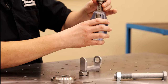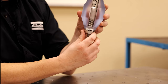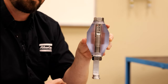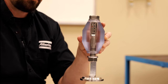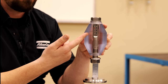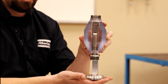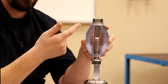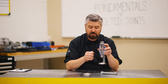So if we build up this joint here and put this together, let's not tighten the bolt — just run the nut down until the parts are squeezed together, so we have basically zero on this scale. If we apply a service load, we see the force increases up to about two. If this is a cyclical load coming on and off, the bolt load is going to go up and down, which will cause a fatigue fracture in the bolt or cause the nut to work its way off. This will be problematic and will fail if it goes out into the field like this.